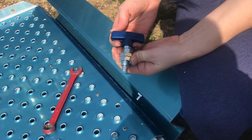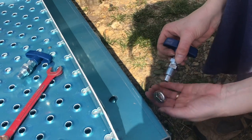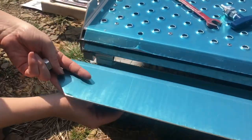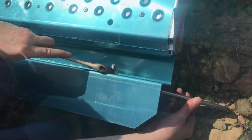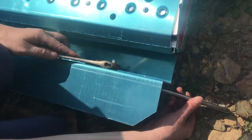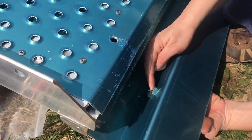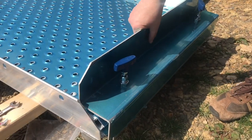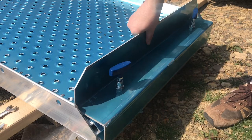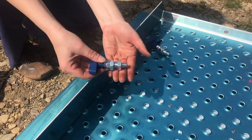Install these spring handles onto the safety gate. Remove the bottom nut, lower the gate, and install it on this side — use the wrench on both sides and snug it up. When you pull the spring handle back the bolt should be flush with the nut so there's enough clearance when you lift it. The pins will snap in place but you may have to wiggle the gate a little. We'll install these handles on the other side the same way.